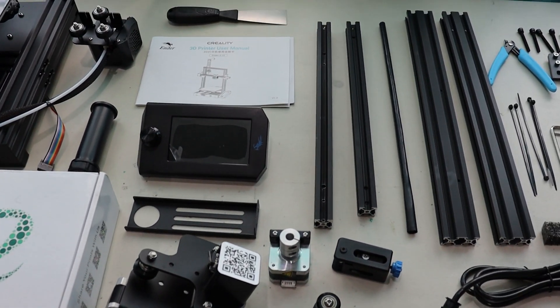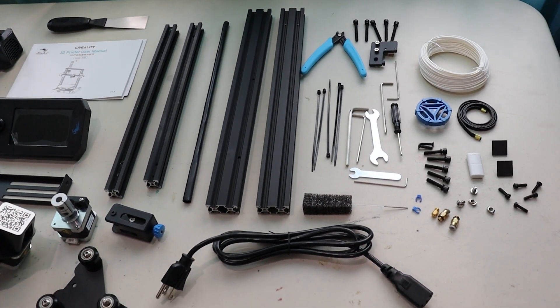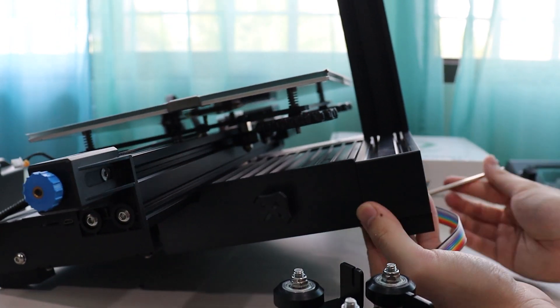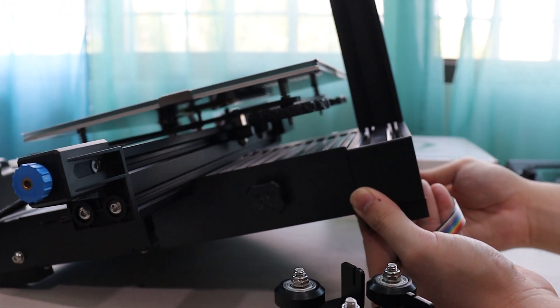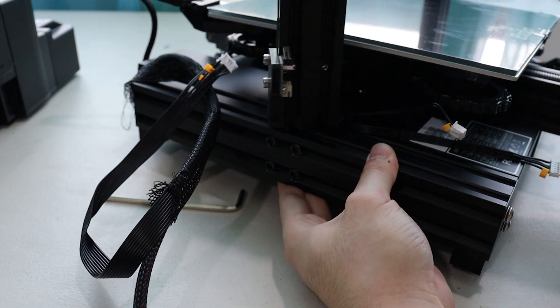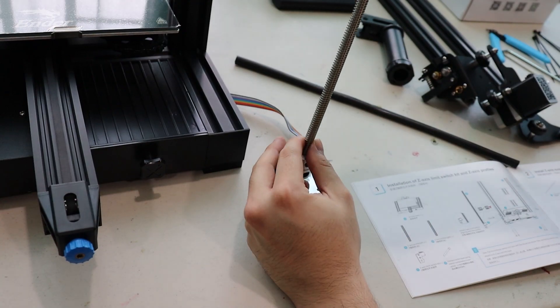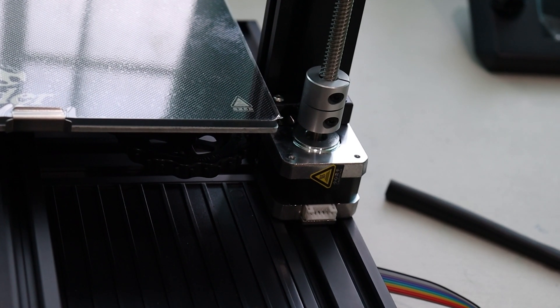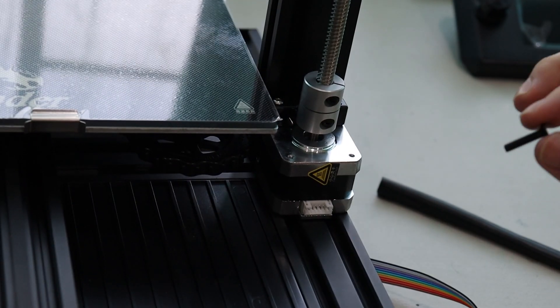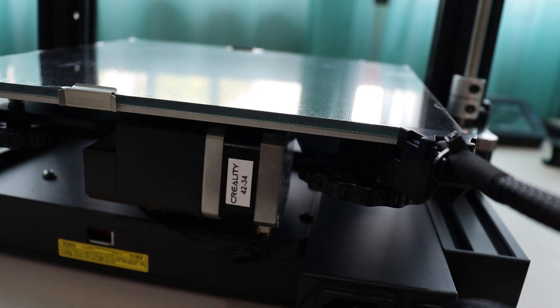Calibration is the next important step. Ideally, set all the parts out so you can see everything laid out first. You install the z-axis — the main pillars — make sure the holes are pointing inwards, on the right bar facing you, on the left side facing you. That's where you install the z-axis limit switch. After that you install the z-axis motor kit and the t-type screw. The t-type screw is lubricated, so try not to hold it for too long — just screw it in right away.